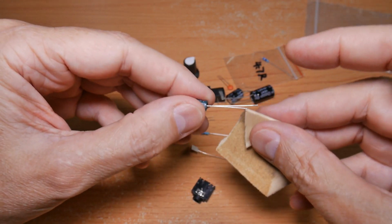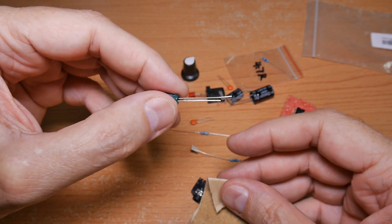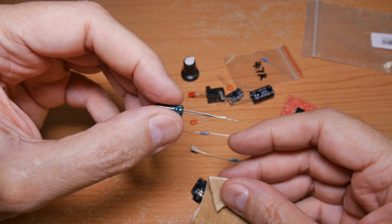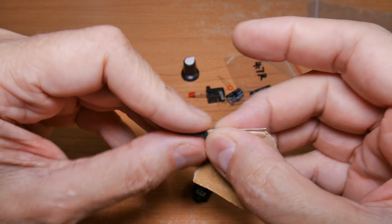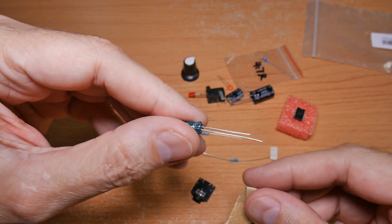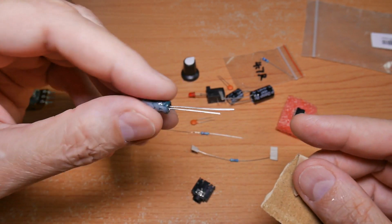If you ever work with lead, like you ever have a block of lead, scratch it and it'll look beautifully shiny. It's really shiny stuff. But within an hour or two, it's starting to gray up again. And that's because it really likes oxygen, and it will oxidize very quickly. And you don't want that oxide on there when you're soldering. Yes, the flux will take care of some of it, but again, that's not first choice.